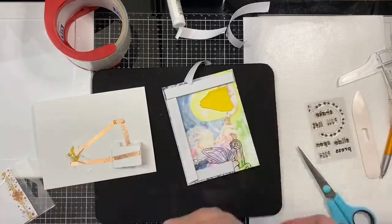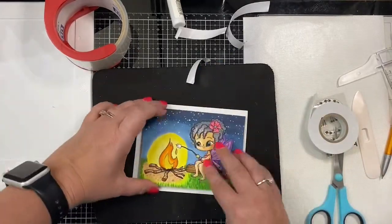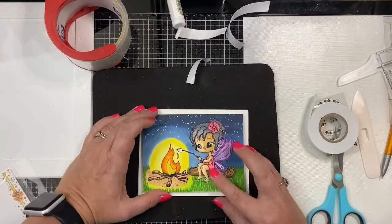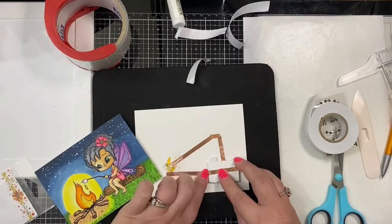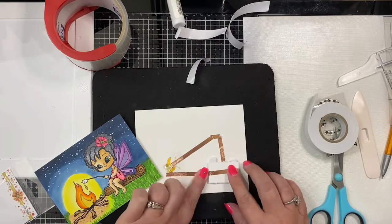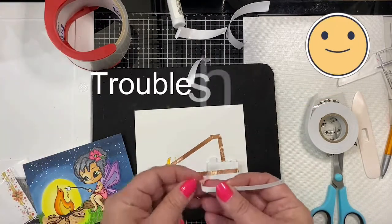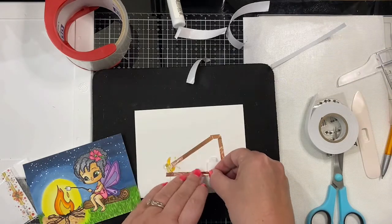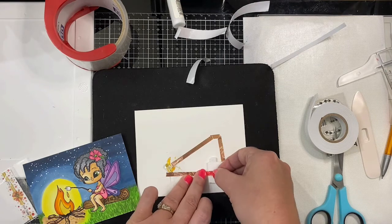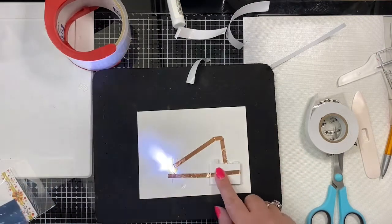And when I did this, I accidentally tore the copper tape with my fingernail along the bottom edge of the battery holder, which broke my circuit. So I had to add another strip of copper tape on top of that to fix it. And yes, it is working so much better now. That's definitely what I needed to do.